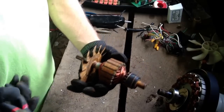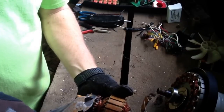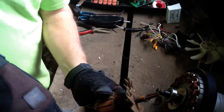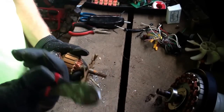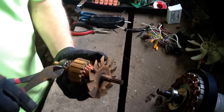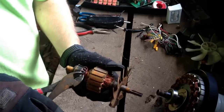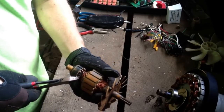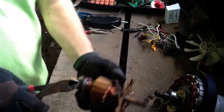The easiest way to do this is take your nippers — it's kind of dark in the shop, but those little clips right there — just get a hold of that with your nipper and bend it around; it breaks off. You want to keep that because that's copper too, and that's going to free up that copper winding in around the inside there. Just nip off each one of those and lay them over to the side.